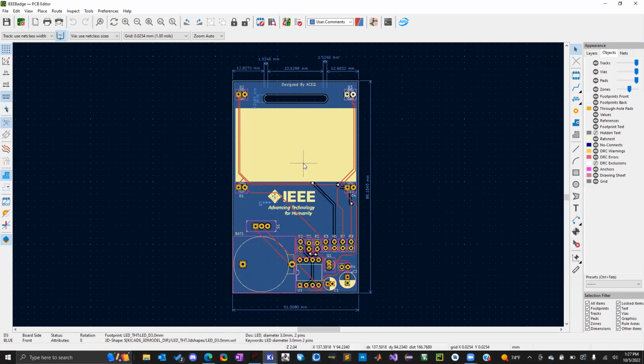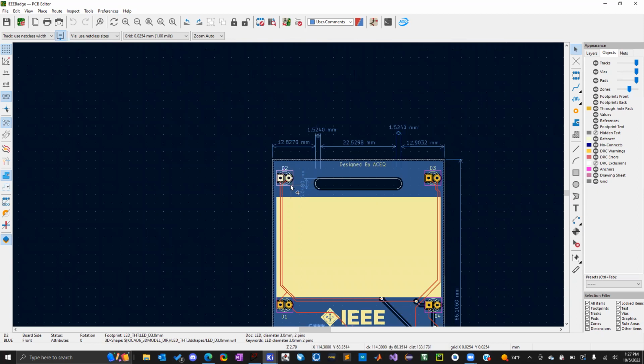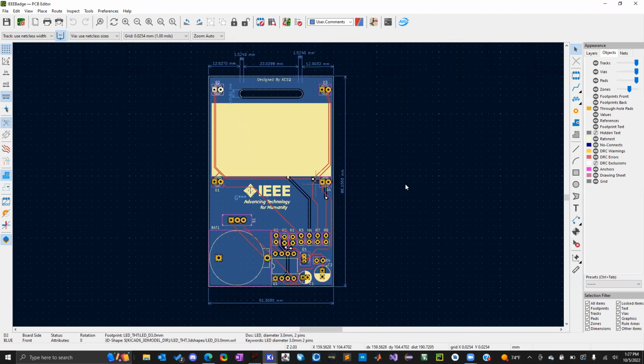So I'm pretty confident that this will work, hopefully. When I order these, I'm gonna order just five, and then I'll put together a circuit, make sure it works, and then if it does, I'll print them in bulk, and we can have other students assemble them as well. That's part of the reason I picked all through-hole components. You could have picked all surface mount and then have the manufacturer put the components on for you, but I wanted to do through-hole so I could have students learn how to solder as well, because that's another useful skill to have.